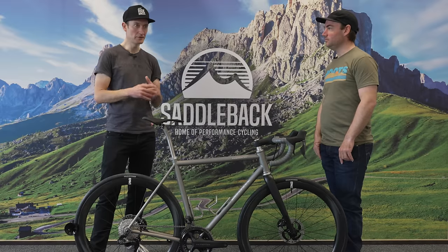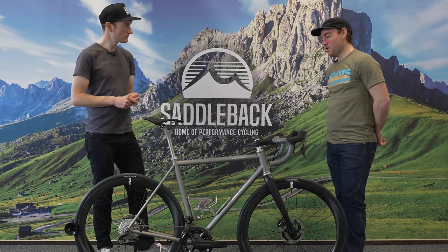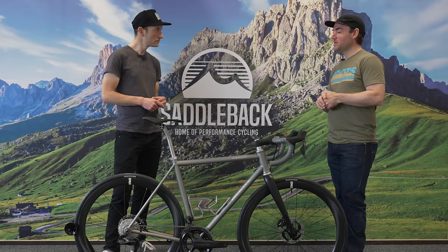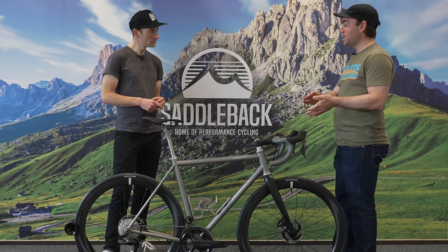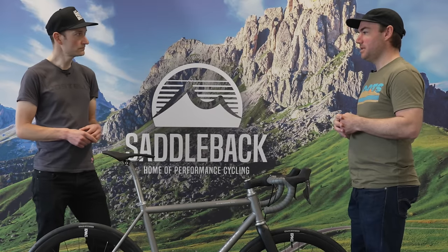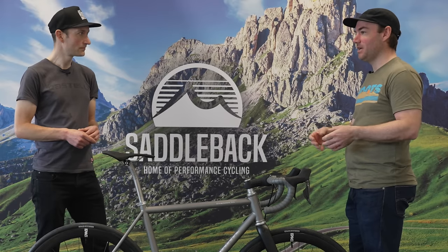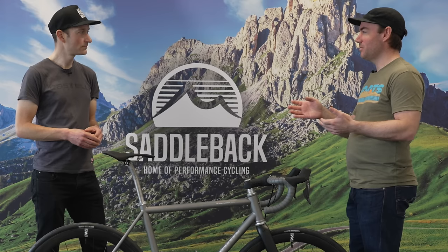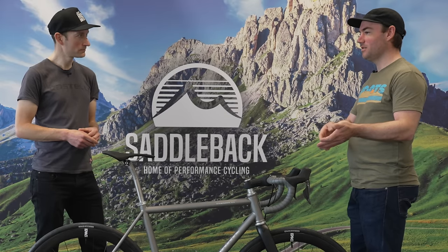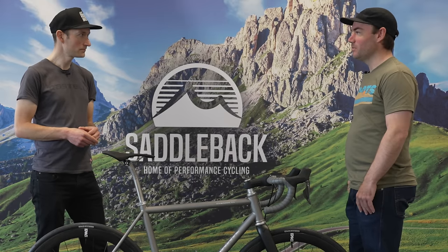Over the last few years we've seen some amazing finishes on Moots bikes in the background — can you get those finishes on this bike or is it a limited palette? It's not limited. One of the things unique to Moots and to titanium specifically is the way we're able to finish these frames. We default to a brushed finish, then bead-blast around that final pattern. But with titanium you're able to anodize differently from aluminum — instead of dipping in a pigment, you do a surface oxidation and control the color through electrolysis. We do many different surface treatments to create unique colors and patterns that are unique to the material. On our website you'll see a list of all our premium and signature finishes, available on every model.